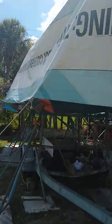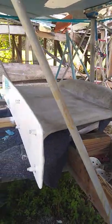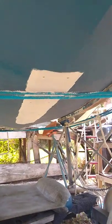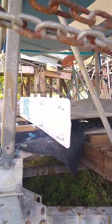Since we talked last I've made a good bit of progress. The keel is completely encapsulated — that's the keel — in epoxy and laminate. I did five coats of barrier coat. You can see that white spot there where the keel flange is gonna go; that is the last coat of barrier coat, the white, and on the keel flange itself.